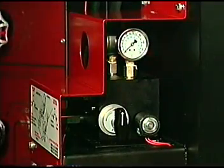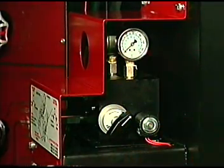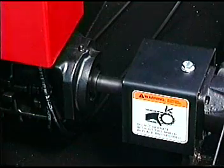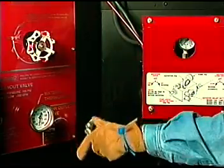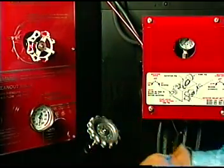Start the material pump. After maintaining the cabinet temperature at 275 degrees, engage the material pump by turning the lever on the right side of the manifold clockwise. The pump may start slowly. As the pump is heated, it will turn more freely until it reaches full operating RPMs. When the pump is turning freely, in about 45 minutes, open the tank outlet valve to start the recirculation of material inside the machine.